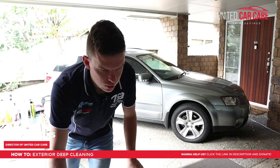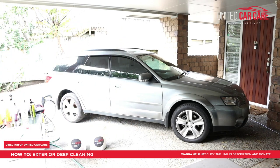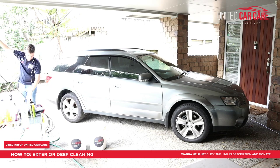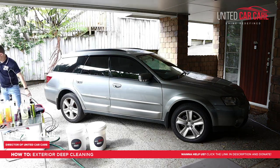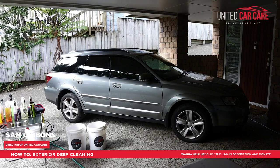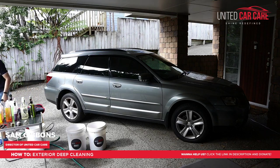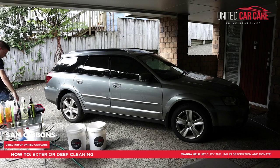Hello Lloyd, I'm just getting last minute things set up. For anyone who uses a water blaster, make sure you always run that water through for 30 seconds or so first so that you get the air bubbles out of the lines. That will save the motor on your water blaster. So if anyone doesn't do this, always do this.